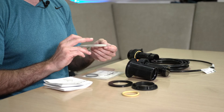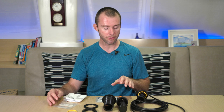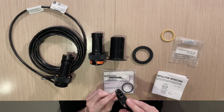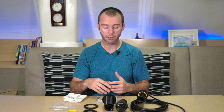Last little packet is the silicone dielectric compound and a little safety wire. You put a little bit of the silicone on the O-rings as you clamp those down to make sure you get a nice good connection. The safety wire is intended to seize the cap for the through-hole, the blanking plug cap, and the tri-ducer down so you don't accidentally have the caps unscrewing themselves and causing water ingress, which you never want to have.